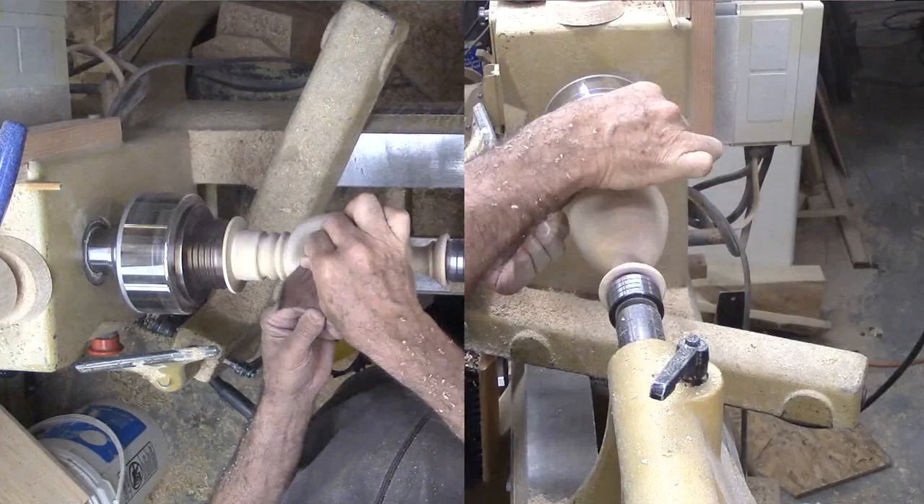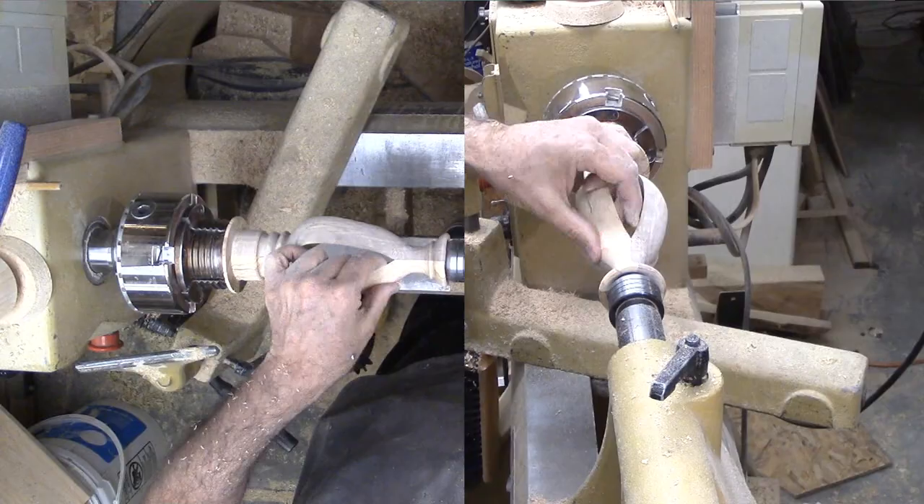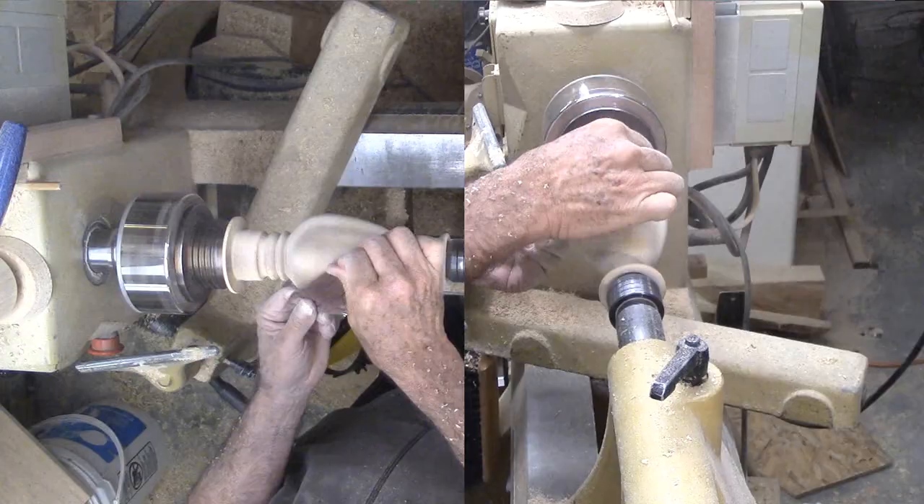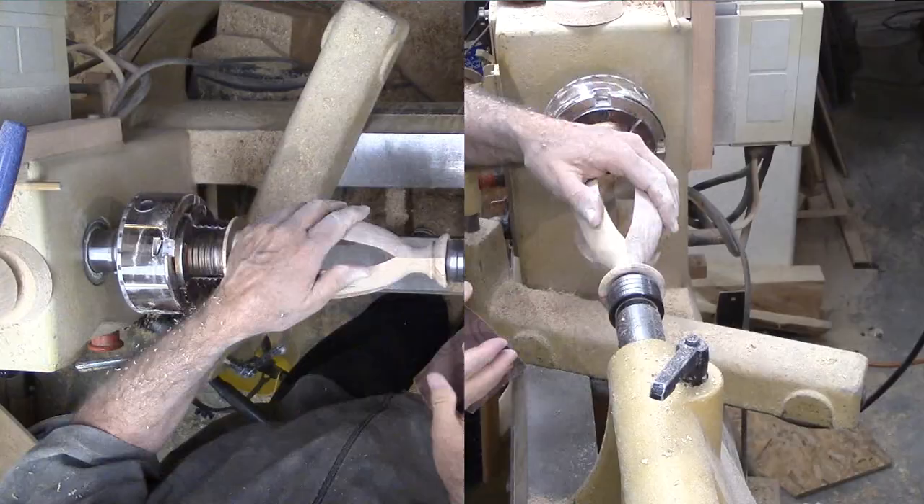This is tough with the voids, and the edges are very sharp. For this area, I'm increasing the spindle speed and holding the sandpaper by the ends so that only the middle hits the wood. While this may tend to round over the leading edges a little, I'm okay with that since I'll be sanding those edges anyway a bit later with fine grits to ease them.